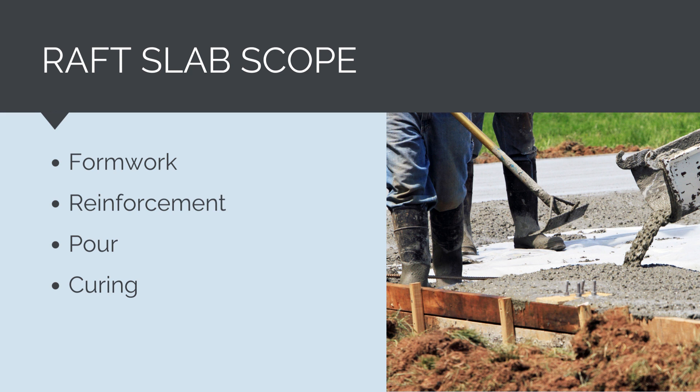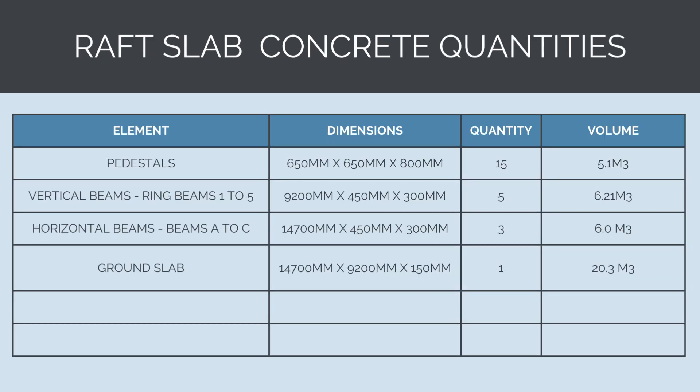Importantly, it is worth noting that the design does not show any construction joints or saw cuts. We are going to assume these are not required due to the size of the slab, though we may wish to check this with the client and architect. We need to check the overall quantities of the slab to allow for materials and to check time durations of the tasks. Calculating quantities is straightforward — we look at each component and multiply the dimensions together to get the volume. This method involves some overlap, but it is better to overestimate slightly than to be short on volumes. Summing all volumes together gives a total concrete volume of 37.5 cubic meters. Adding 15% for wastage gives a total pour volume of 43.1 cubic meters.